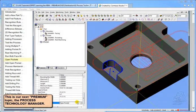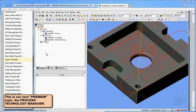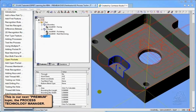So it's wanting to see this as a pocket, because in essence it is a pocket. So our recognition rule here of is open pocket is a little bit weak. It's really not going to accomplish what we want. Now how else can we designate this as an open pocket separate from the big pocket that we're cutting?